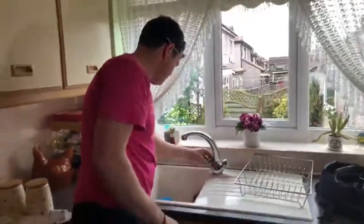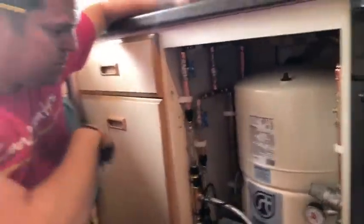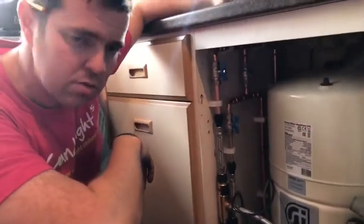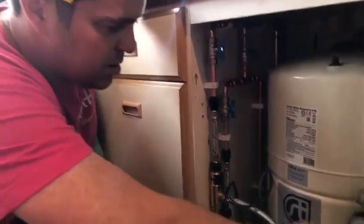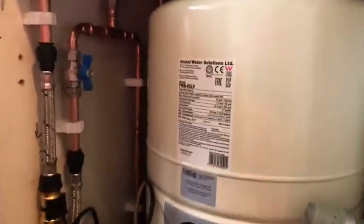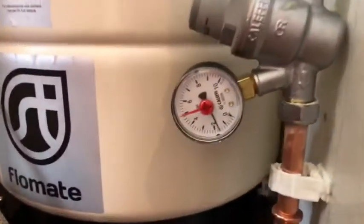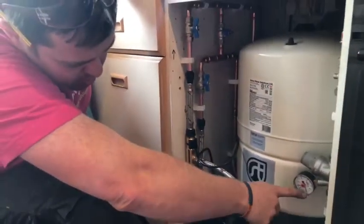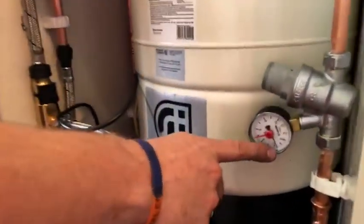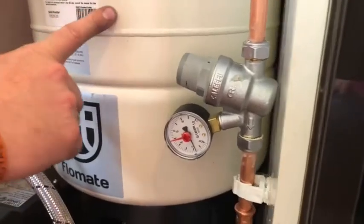Not really ideal. So we're going to close the bypass and open both the pumps. Now the pump's going to kick in because we've drawn pressure and volume out of the pipework. What the pump's doing now is loading the vessel and loading the pipework in the building. We'll just let it run, and as you can see the PRV's wobbling because we've got water pressure going in, water flowing through it to load the accumulator.